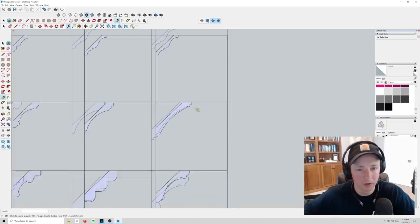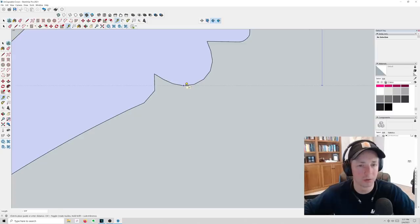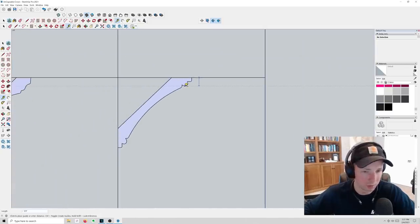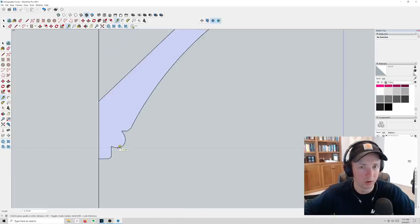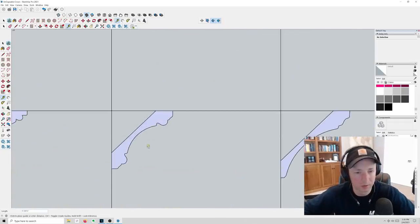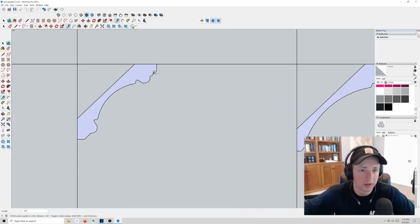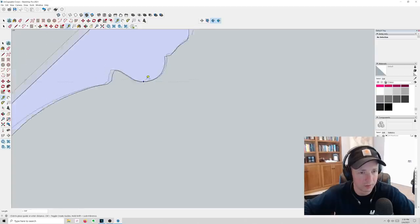Let's take a look at a profile that wouldn't be copable. This is a double beaded crown, and the bead — at least one of the beads — will often come up past the horizontal plane, and that little section where it comes up past horizontal is going to make this profile not copable. This particular profile is actually not copable on both beads. Here's another one — anytime you've got the bead, you know it's going to be a pain. Coming down on this bead, it's coming up past level — majorly not copable.